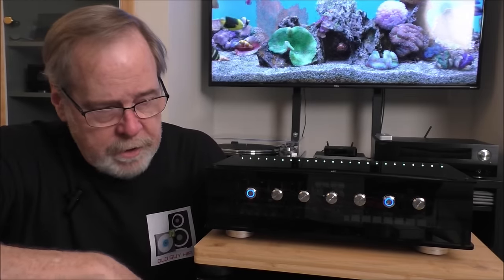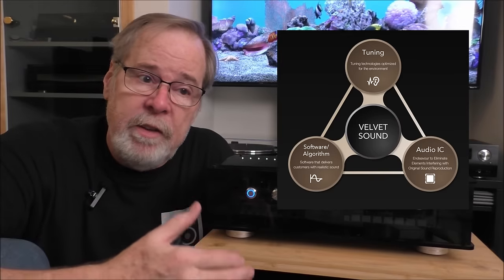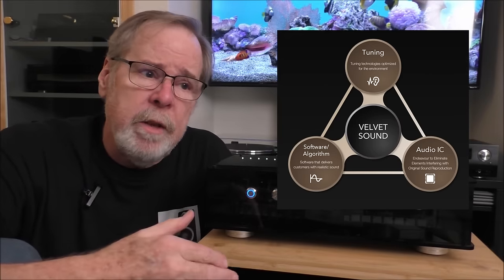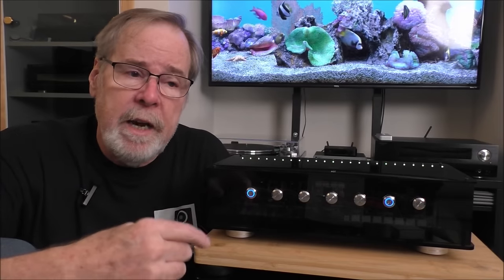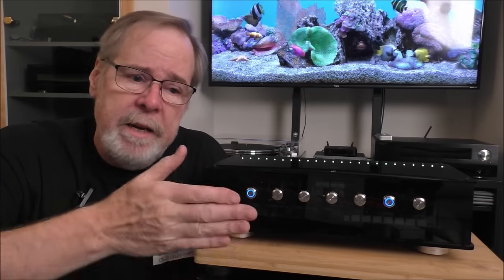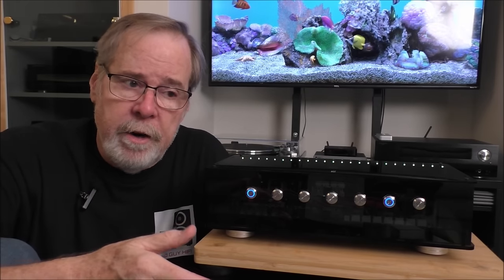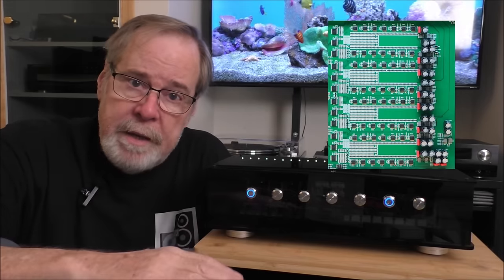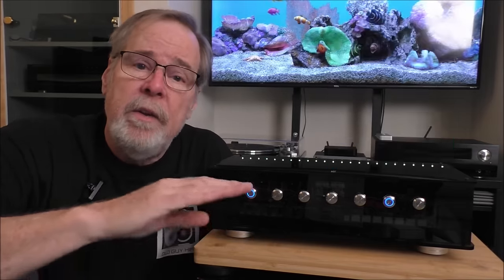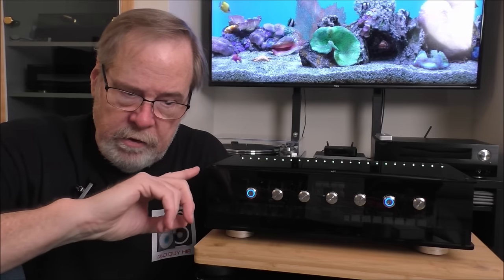And let's talk about those DAC chips real quick. AKM developed this technology they call Velvet Sound Verita, and it started with the 4490 and 4493 chips. Now, the 4499 and 4493 were single chips, and they kind of divided the chip in half, and I'll explain why. I've done recently some reviews on R2R DACs, and the thing about a resistor ladder DAC or a resistor multi-bit DAC is it can decode 16-bit or 24-bit PCM without oversampling, and I think that's really important. And I'll talk about why in just a second.